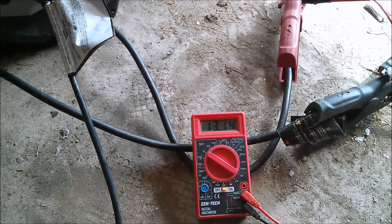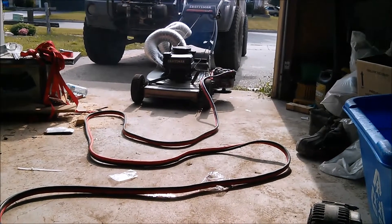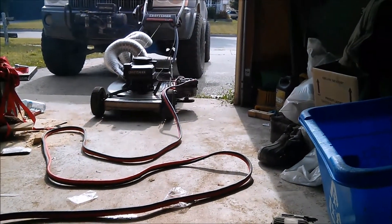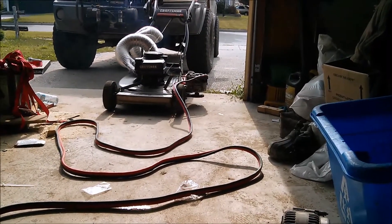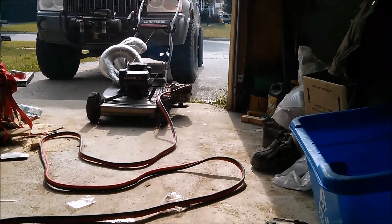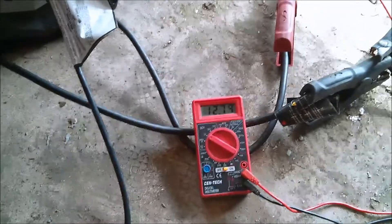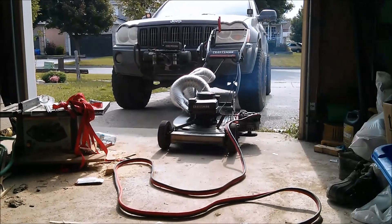Now you can hear it starts having trouble and the voltage starts dropping. I only have it at idle — I can turn it up and put it up to almost 50 amps, and it would have no problems running this light at all. But the pulley on it is aluminum, and the way I fastened it on there is just not good enough for full throttle. So I've got to get some steel pulleys which I will weld to the bottom of the alternator, and then I'll be able to go for a full load test. For now, this is just a little tiny camping use for this little homemade generator. It will run a lot better once all the oil burns out from around the engine.